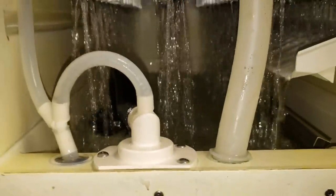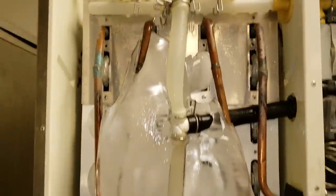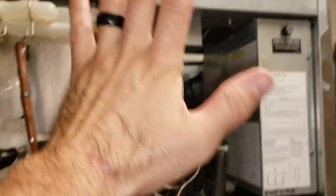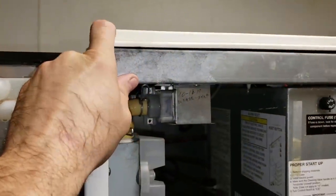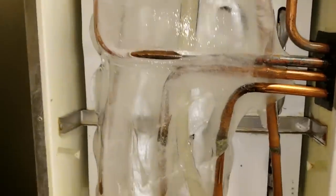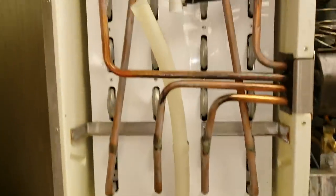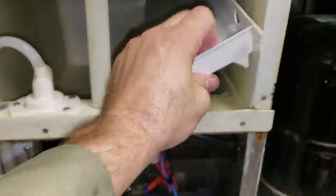For the most part this looks defrosted inside — now I've got to hit the outside. I'm doing this slowly and being cautious because there's electrical stuff over here, and there's a solenoid up there that's energized. I put a cover on it, and we're using the water pump to our advantage. We're fully defrosted, so I'm putting the cube guide back in. I pulled the side cube guide out and cleaned behind it while I had the opportunity.